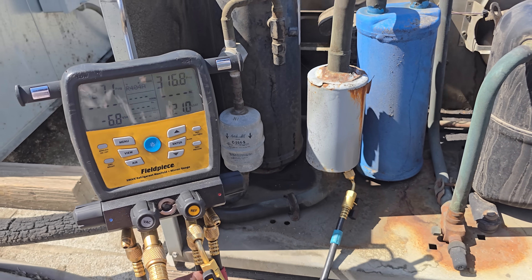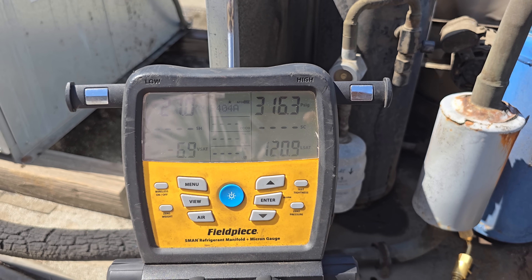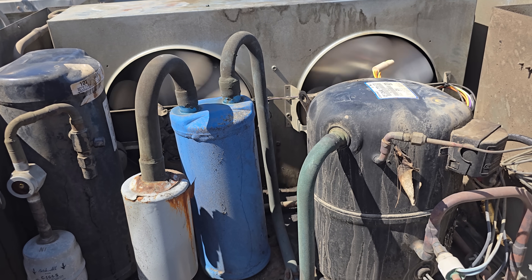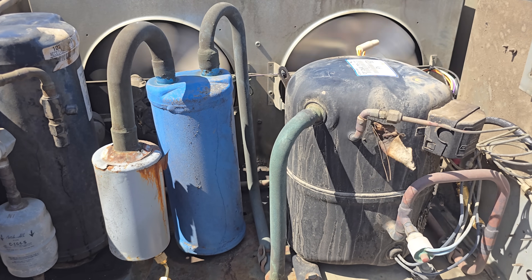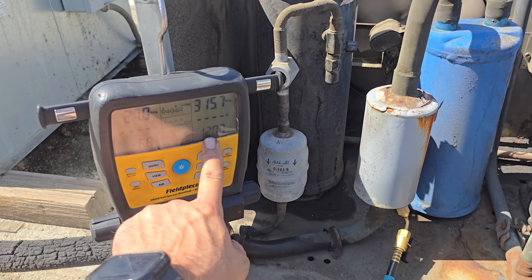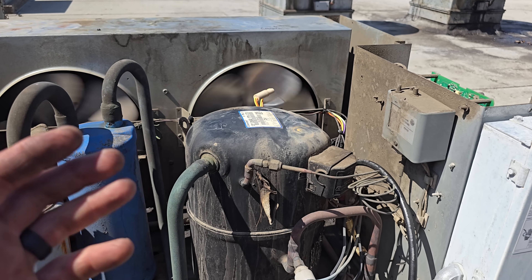A question was asked about the no-more-than-30-degrees-over-ambient rule for liquid saturation temperature. My thermometer said 103-104°F and my liquid saturation temperature is 120°F, so we're approximately 20 degrees over ambient - that's fine. We never want to see more than 30 degrees over ambient, but it's not a one-stop charging metric. If it is over 30, it could be overcharge, it could be a bad head pressure control valve bypassing when it shouldn't be, a dirty condenser, or a bad condenser fan motor. Had we troubleshot this unit with a bad condenser fan motor, we very likely would have seen more than 30 degrees over ambient.